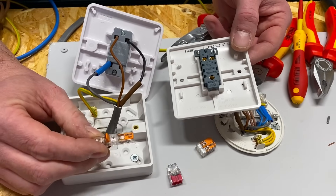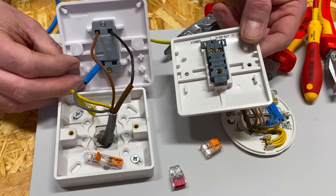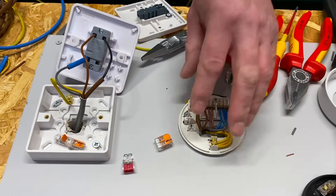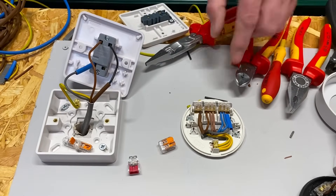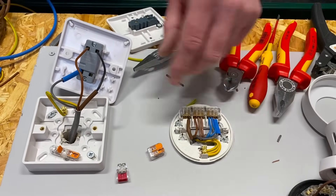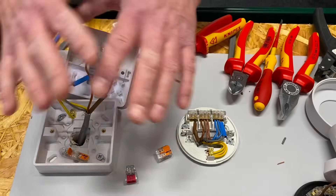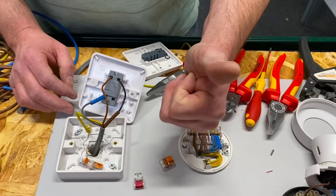I'd love your thoughts on that one as well. I'm probably going to favour leaving a Wago-style connector in the back of the switch, but you could use those Schneider and Hager switches that allow a neutral connection too. Have you been introducing a three-core-and-CPC from your three-plate method, bringing the neutral down to your switch to future-proof for smart switches? Or have you stuck with the traditional twin-and-CPC? Please leave your comments below. By introducing the three-core-and-CPC you can get a neutral at a switch even though you don't need it, and therefore future-proof the installation. I hope this video has been some help.